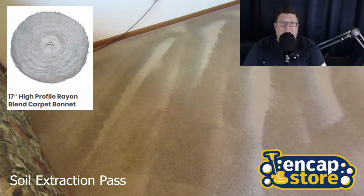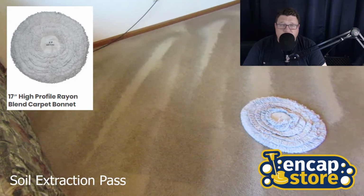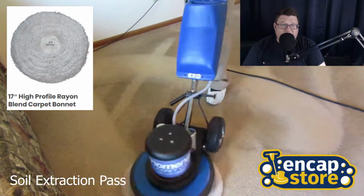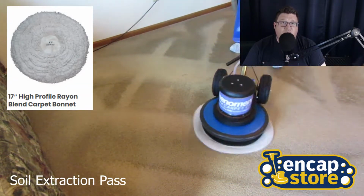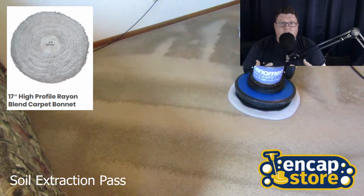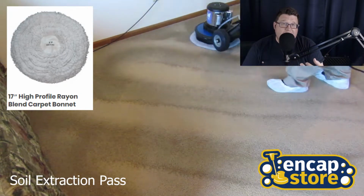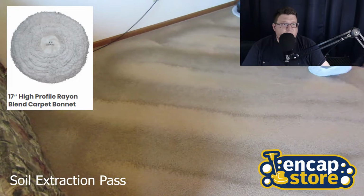But you want to run it dry, and so you get the most amount of absorption. And as far as approach, we're going to do it very much like the preconditioning step. We're going to work all the fibers in multiple directions, getting us the most amount of absorption of soil and moisture so we can bring those dry times down for our clients.